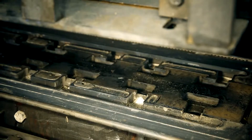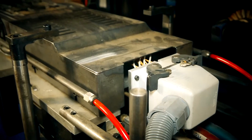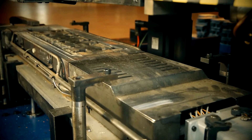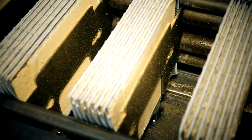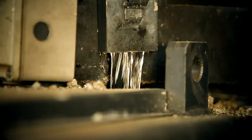Mould change is easy on account of the special design. Electricity and water connections, fixing mould and assembly of pump on mould are performed fast and easily. Casting process is realised sensitively and correctly, thanks to the special system that provides flowing of melted lead from melting pot to mould, ensuring smooth lead flow to each chamber of the mould.